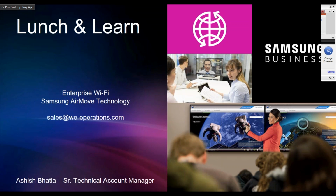Okay, what other voice features are supported on the Samsung APs? As I was mentioning in the middle somewhere, we were talking about controlled voice optimization. The Samsung AP does have the capability to recognize that there's a voice call going on, irrespective of whether you have the VoIP application or not. We are able to recognize the G711 call and change the contention mechanisms to provide much better quality to voice calls than your regular background traffic, if you will.